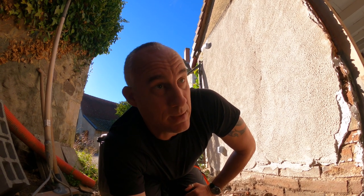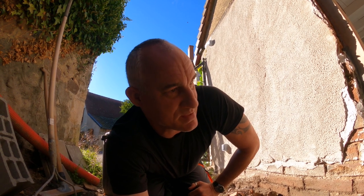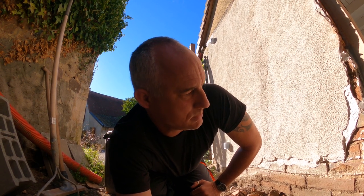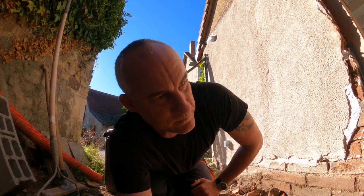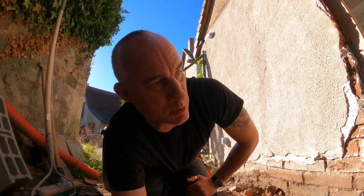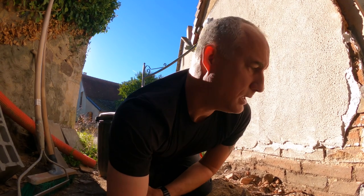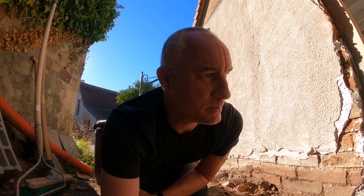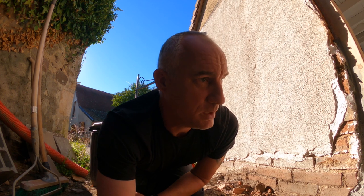Yeah, I'm gonna do that today, and the reason being that one of these days I might accidentally step on the stone and dislodge everything, and that would be a shame. So yeah, I'm gonna pour concrete, fill all those nooks and crannies in there, and tie the whole lot together. Probably stick in some rebar. Better safe than sorry. Yeah, I'm definitely going to do that today. Build a nice box, line it with plastic so that the moisture from the concrete doesn't sink into the soil below,